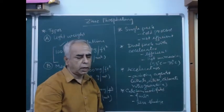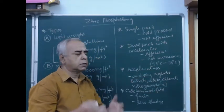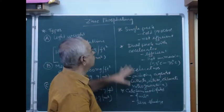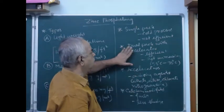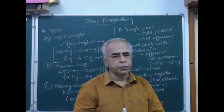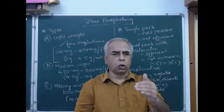The better crystal pattern can be achieved only at 55 to 70 degrees centigrade using appropriate accelerators. Accelerators are nothing but oxidizing agents like nitrate, nitrite, chlorate, nitroguanidine, etc. In a dual pack, you have to maintain the temperature around 50 to 55 to 70 degrees centigrade. I will be talking about the heating element and what are the expected problems while processing the phosphate.